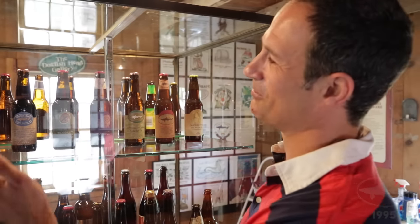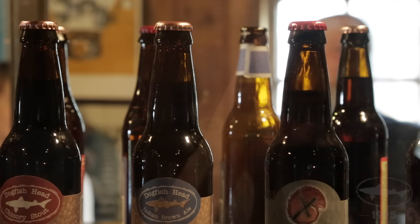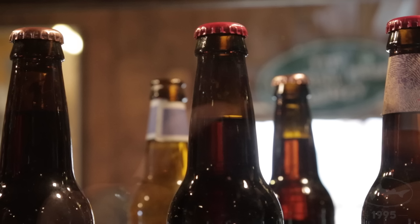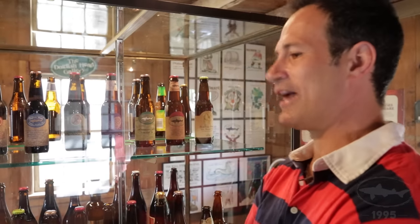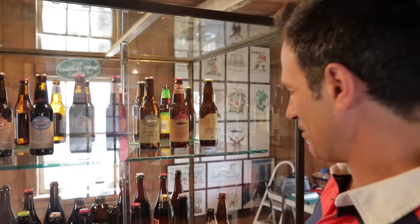It's also interesting when you come in and see some of these old bottles — you see very varying fill heights. Back in the day we had a piece of shit East German soda bottle filler. At the end of a bottling run we'd lay out all the cases on the ground and pick through them, taking the 13-ounce fills and the 11-ounce fills and mixing them in with the 12-ounce fills so that every six-pack averaged 12 ounces per bottle. We were kind of all over the map.